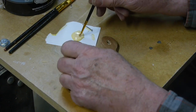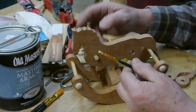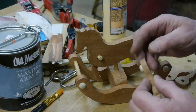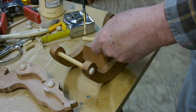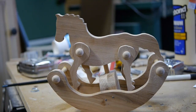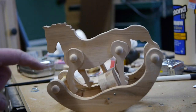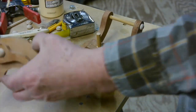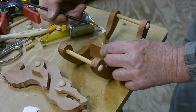I'm getting ready to put the dowels into the legs — those dowels are one inch long — and I'll put a little glue on the other end before putting the other leg on. We've got one straight leg and one curved leg, and we want that curved leg sticking out farther so it looks like the horse is stepping. The curved leg goes on the left up front and the straight on the right, then the opposite on the back. The dowel holding the horse body onto the block is an inch and a half long.